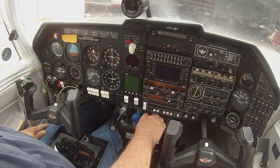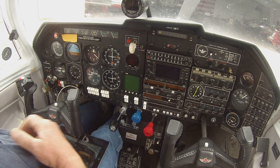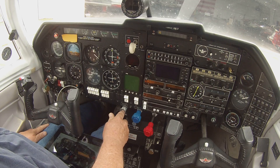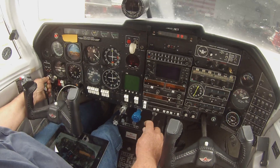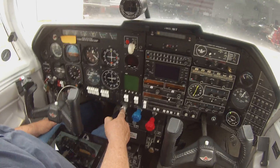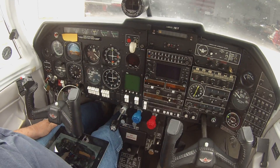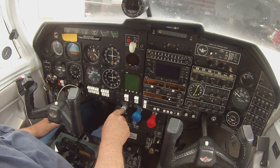We're back to about 750. I'm going to shut her down. This time, just to show it doesn't really make any difference, we'll just shove the throttle halfway in. There we go — see, you can use the mixture as a throttle. Then reach over and ease it back. You can ease the mixture on in. Alrighty, well that's how we do it.